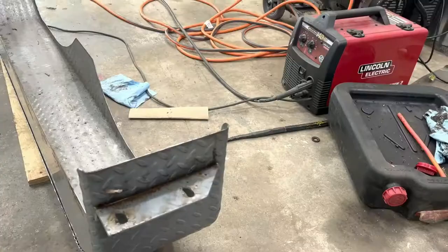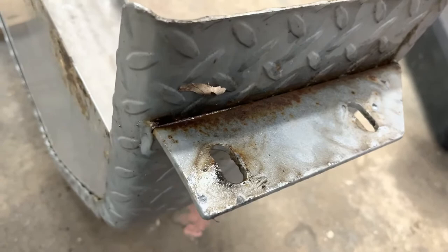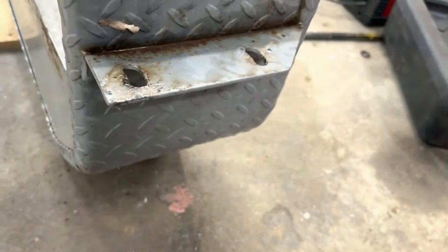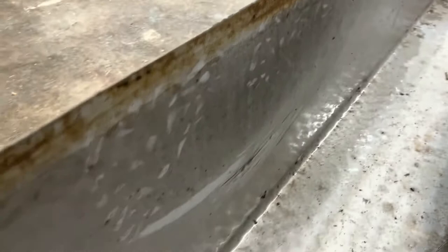Let's get these welded up. We'll pop this back into shape. I did notice this weld right here came separated as well, so we'll go ahead and grind that down and weld it together. Everything else looks pretty good through here. There's a little tiny weld inside here, and I'll try and go down the backside of those. Here's another look at the powder coat — we did a review on this Diamond C trailer and talked about how the powder coat was not as good as maybe advertised. Back underneath here you can see all this rust forming; it's just not good penetration. All on this backside where all those rocks have just been sitting has just deteriorated.